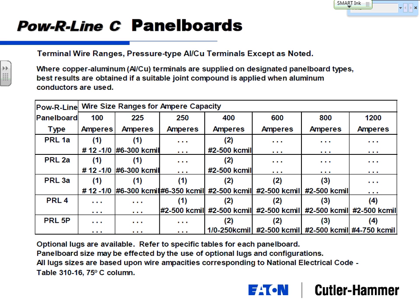And there are sometimes options if you need to go one size bigger or so for voltage drop considerations. You get a bigger cable, you can lessen your voltage drop. But it's not going to be astronomical. You can't just choose any cable. So it's always important to look at the cable sizes to make sure what you're pulling in there matches or can fit with the panel board that you're using. There have been cases where somebody had a really long run and you had to get a larger rated panel board just to be able to fit in the cables because you need more space to bend those things.